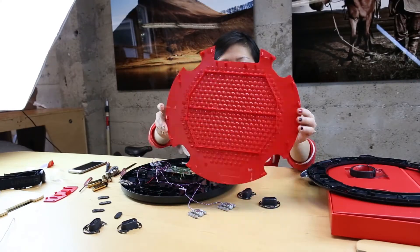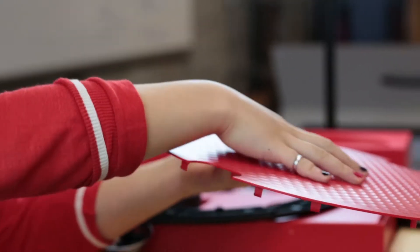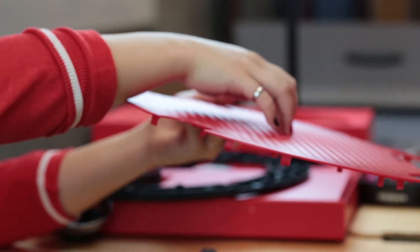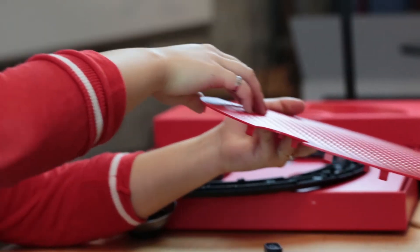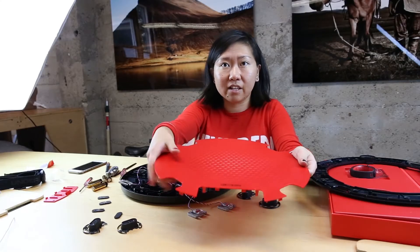This thing is a single piece of ABS — red ABS. They added all of these indents not only for looks — it looks really cool and feels really nice — but also to increase mechanical rigidity. If the plate is completely flat with no ribs, it will flex very easily. But with these divots added in, they don't flex as much.